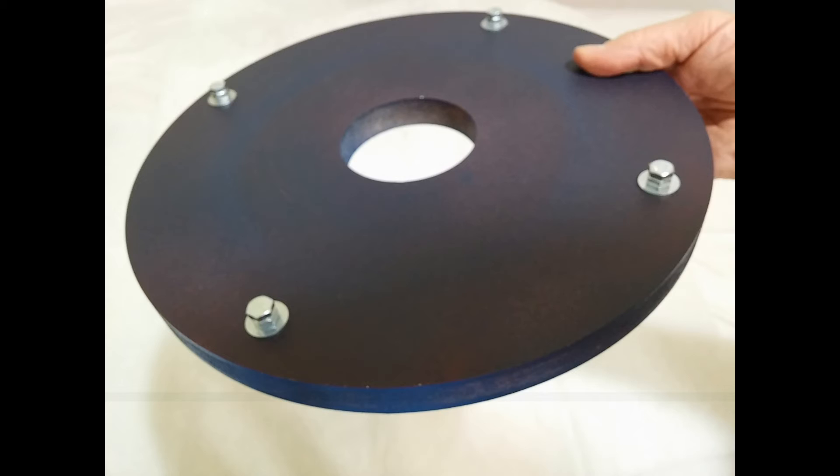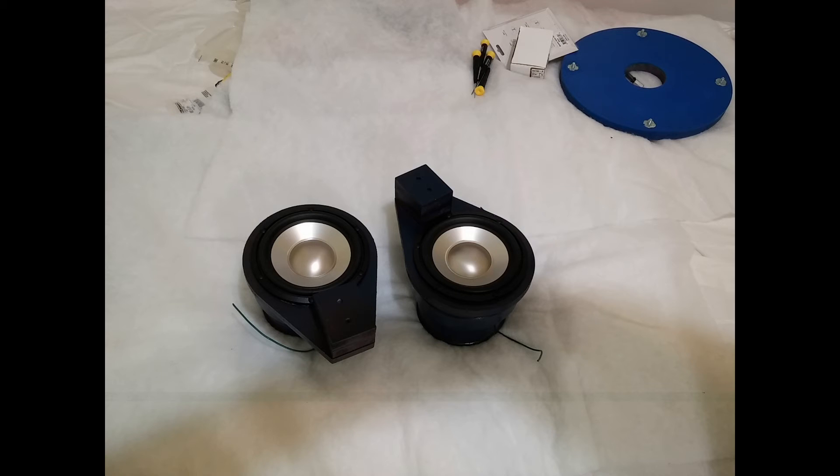The base, as you can see, fully painted with the hardware applied. I'll talk about that hardware specifically later on — the M6 hardware for my custom leveling system: a machine screw, large washer, T-nut, and regular nut for each foot. Here are the low-frequency driver assemblies completely put together, all glued together and ready for assembly.